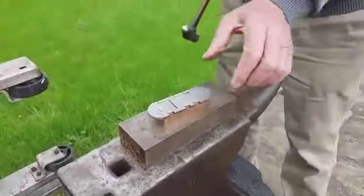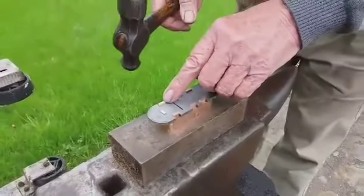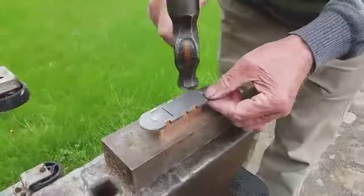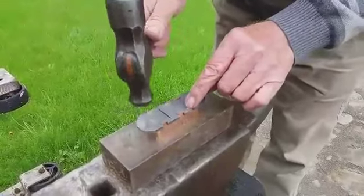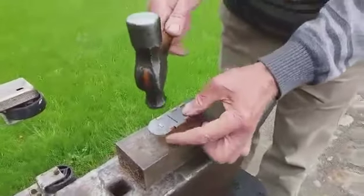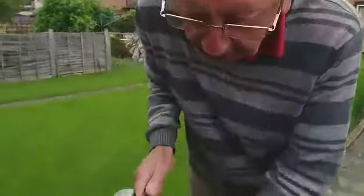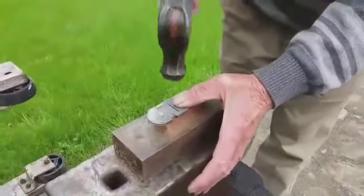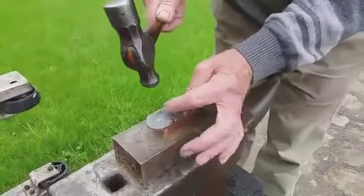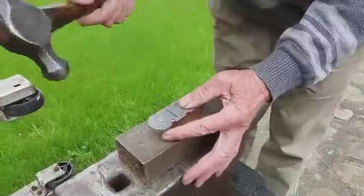So upside down, I start normally with these two points here, forcing this piece of steel that way, and these bits on the edge leading towards the mouth, forcing this bit that way to help close the mouth. I hold it firm and I have to strangle my hammer — hold it up here — to get accuracy. This is a bronze body, superb for peening, and machine tool steel for the sole. I've clobbered that up, pulling it that way, same this end.